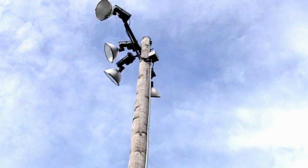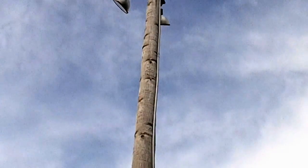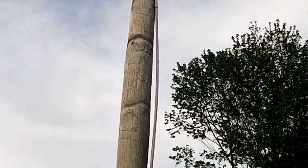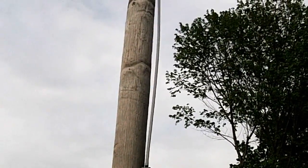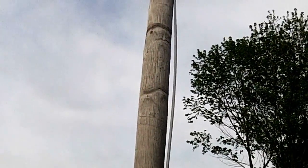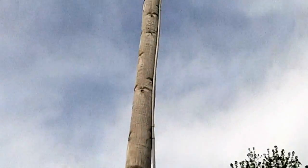Here I'm taking a look at the PVC pipe that's run up this pole. If we follow it all the way down, we'll see there's not nearly enough clips. NEC section 352.30 requires supports every three feet on PVC pipe this size. That's about 30 feet of pipe, but there's only three clips.